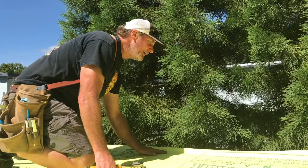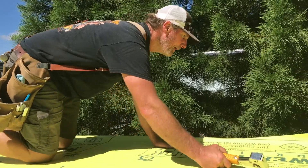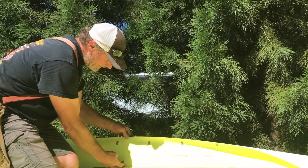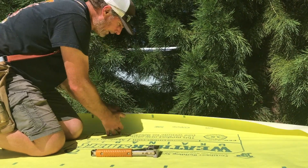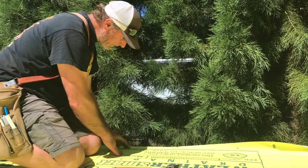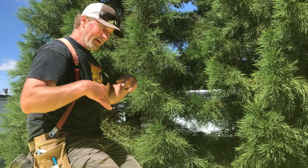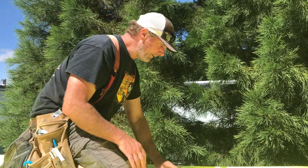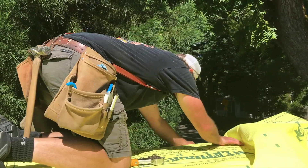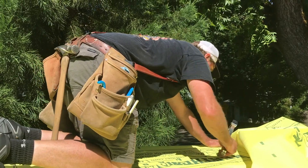I'm tacking the house wrap on — we're overhanging six inches onto the sheet of house wrap below, then nailing it up from the bottom of the truss. I'll want to fold that bottom edge back because I need to nail this sheeting into the lower sheet, making that connection. I'll keep it fairly straight and get it tacked down at the bottom.